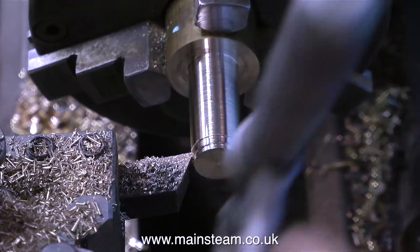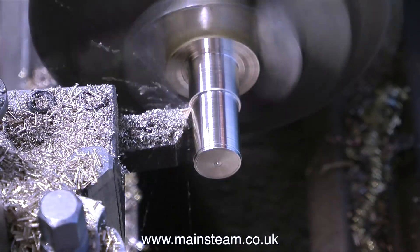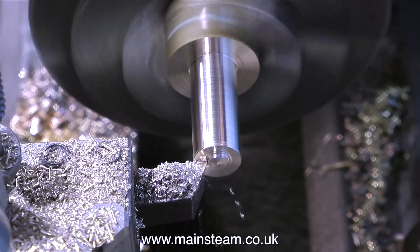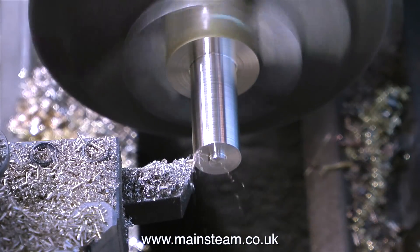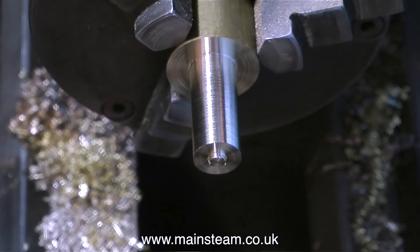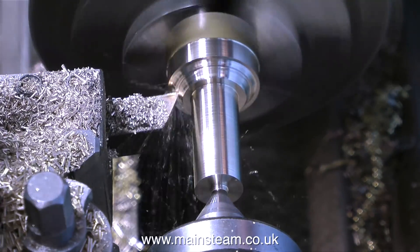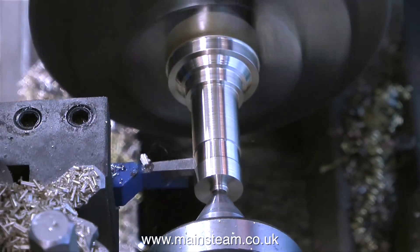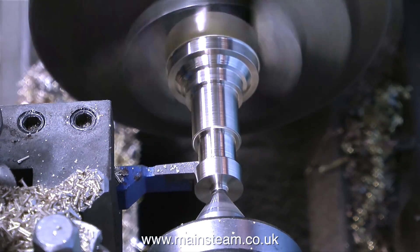This clip is speeded up because there's a lot of it and it would be very boring. At the moment I'm turning the end of the piece of bar, and this small protrusion fits into the recess that I made in the bottom of the turret. This clip shows the problems that I'm having, because first of all I parted off a lot of the bar. I have to pull the bar out of the chuck, and of course it's not going to be very well held in the chuck, so I have to drill the end with a centre drill and use a live centre. The column is still going to be too small, but I'll continue.